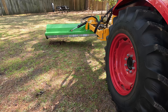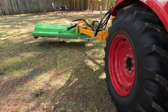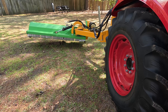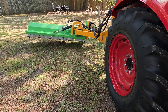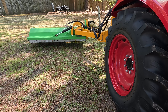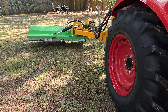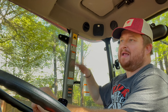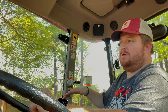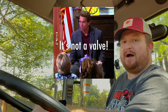So anyway, if you want to get just level with the ground, it is just difficult to do. This is all the way out, and now if I want to go down — I want to tilt that side down just a hair and I can't. I'm pushing on it right now without going into detent, but if I go into detent it drops too fast. You see how fast that went? That was in and out. Coming back, it'll let me not do the detent so much, but I have to go into detent mode for it to go down. And with a flail mower on an embankment, you could be under it or over it, so just because you could get one side smoother, you're not always just doing one side. You want a smoother motion in both directions. I'm really hoping that this restrictor valve will help a little bit better.